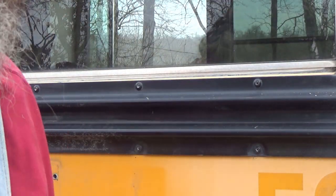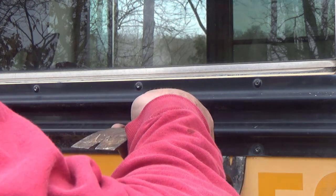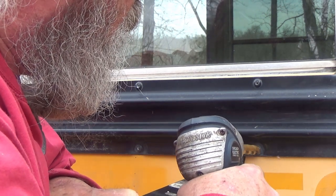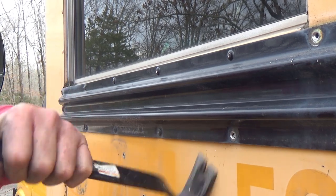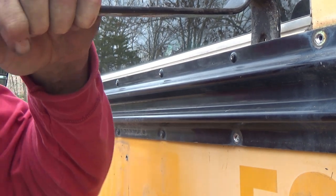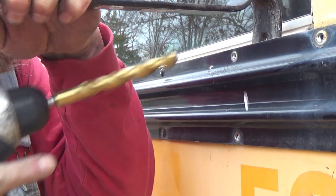Got you all up close. The new best practice goes like this: the problem with these rivets in the middle is that they spin. So if I take my pry bar and put it in there so it can't spin — easy peasy. Same thing: work my pry bar in there so that it can't spin, and then easy peasy.